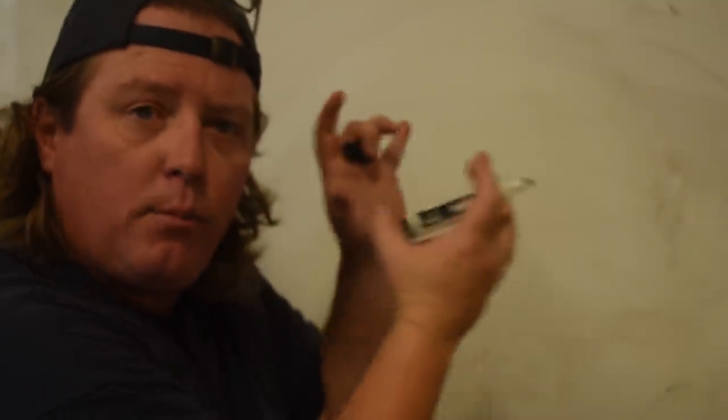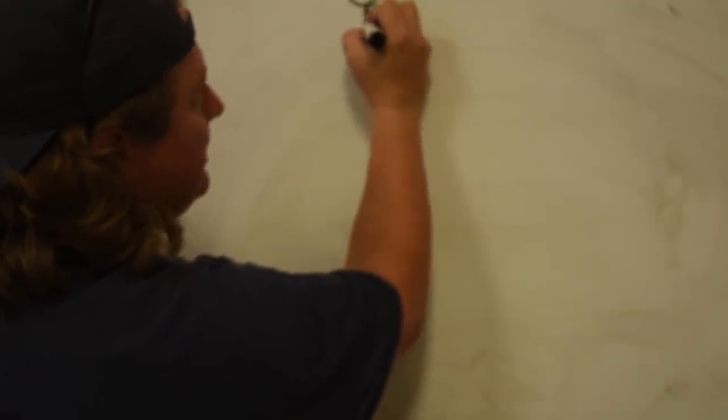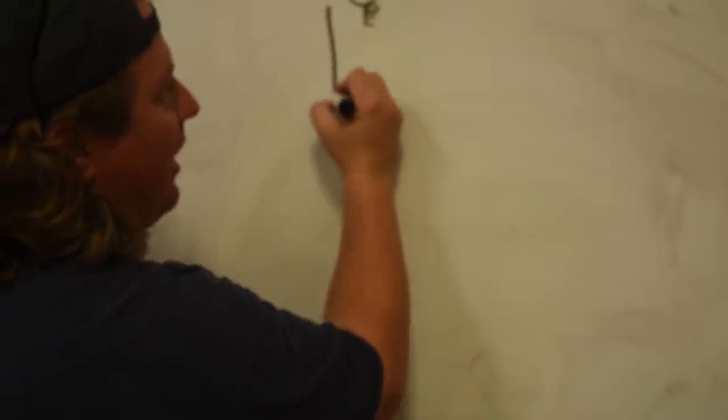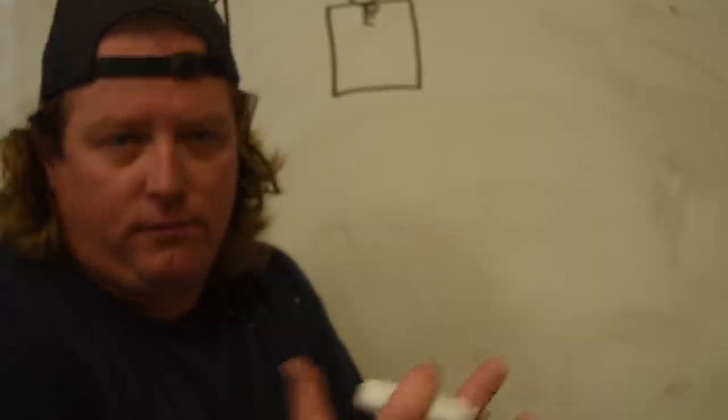So my designs, when I do these for our merch and stuff like that, I basically think of three components in my finials and I don't gussy them up too much. Those three components start with the head of the item. And the head of it is basically the transition from whatever object you have, whether it be a sea urchin, a hollow form wood design, or just the screw on the top of it that transitions down to hold it. The head of the finial is just that transition. And a lot of times it involves the joinery aspect of your finial.